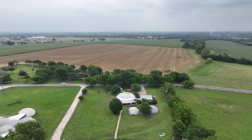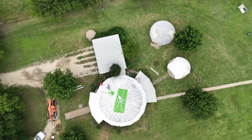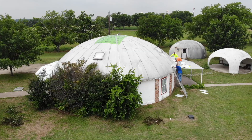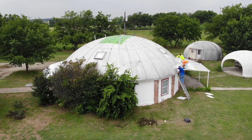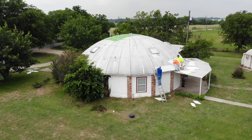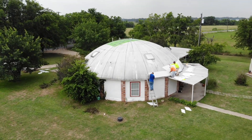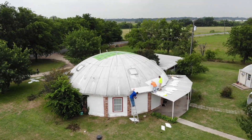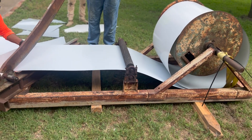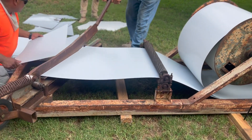So why did we choose steel cladding for this project? The answer is simple — there's too much water in the foam and under the membrane. If we were trying to paint this dome, the paint would be blown off by the evaporating water, so liquid coatings aren't an option. We need something that will provide good UV protection but will also allow any trapped water to breathe out from underneath the roof system. That's where the steel shingle system shines.